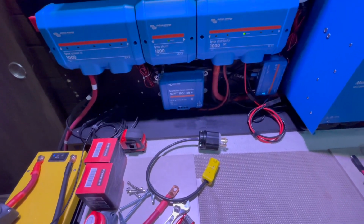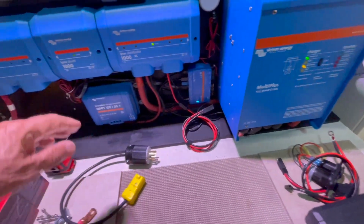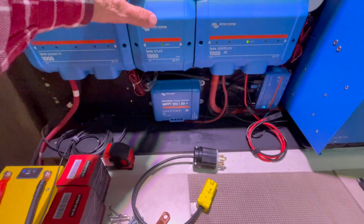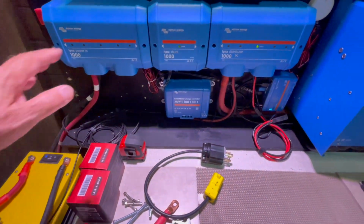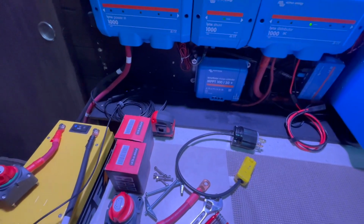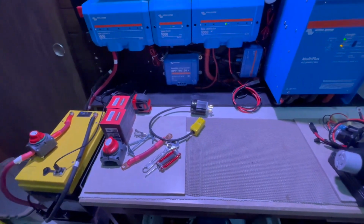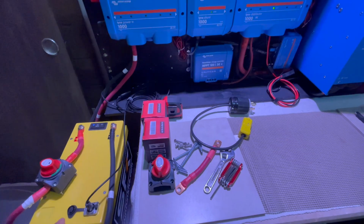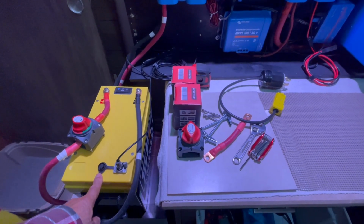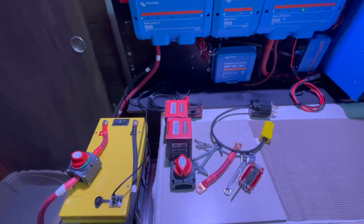I could also set it in such a way that either my inverter or my Lynx shunt controls things. I set it on auto, and by setting it on auto, it will automatically select my SimplyOffGridLife kit. If for some reason the BMS fails, my Lynx shunt takes over. Double protection. So, if you're looking for a battery, try to find a battery that can act like a BMS controller that will actually monitor your system. So you have a backup system.